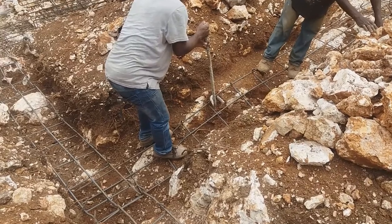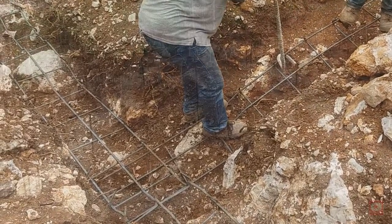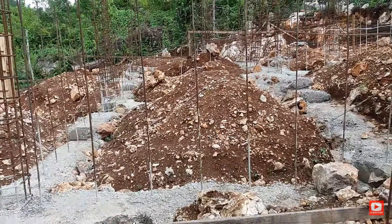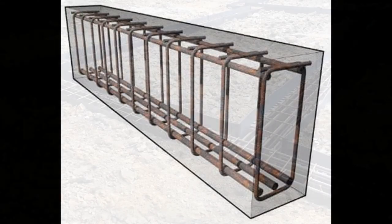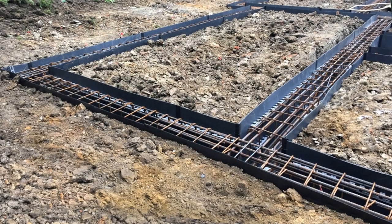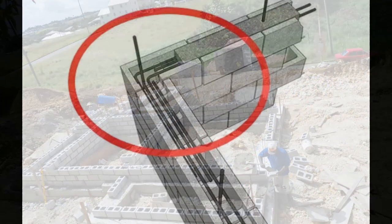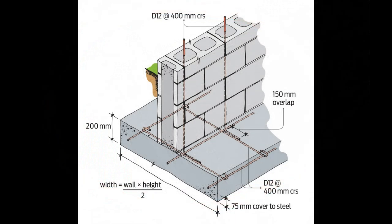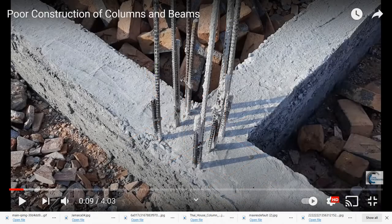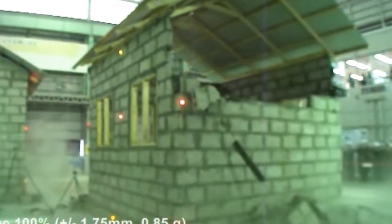What we will do is not go the traditional route of putting matting inside your foundation at the very bottom and then pouring concrete on top. Instead we will put rebar cages into the foundation, tie those together in what's called a monolithic slab, and then build the building on top of that. That way you do not need massive amounts of steel inside your columns — you simply need to ensure the belting around your building is sufficiently strong and that your walls are properly tied in, giving you an extremely rigid structure for the mild earthquakes we generally have in the Caribbean.